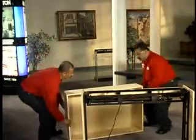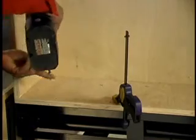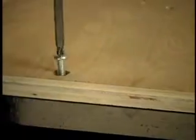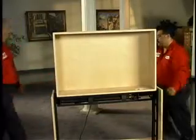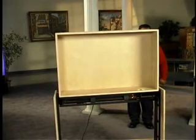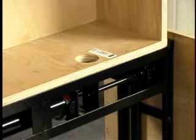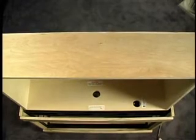You'll want to create a five-sided box to house your TV; that box will then be mounted to the platform. For access purposes, we recommend two modifications to your box. The first is to drill a two-inch diameter hole in the base in order to have access to the limit switches, which we'll be adjusting later. We also recommend that you make the lid removable by using a dowel system.